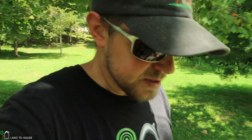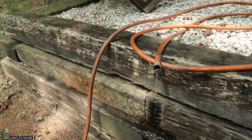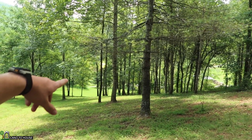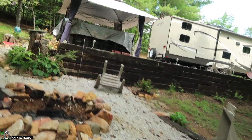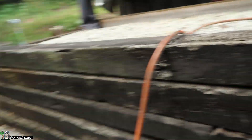That's the plan and I may go ahead and just give it a try next week. I will bring a weed eater down here because this is some snaky stuff. I use the GIS mapping on this hill and it's 62 feet. I've walked it like eight times now. Look at this — nice flow right here at the top. I like it. So that's a good proof of concept to show that yes, we're able to pump from down there to right here. Let's just from the fun of it move this hose up another few feet to this trellis up here and see what we get. Success on that lift as well — that was another four feet or so.